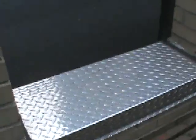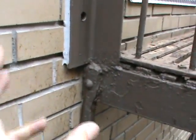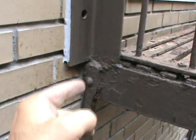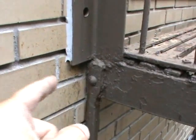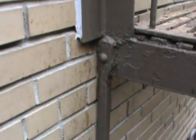Any cement work, identify it so that a mason can do it, but anything within our capability belongs to us. Usually a 4 to 6 inch square of our piece. You got to clean those out and verify it if we're going to load test. If we're not going to load test, that rivet's got to come out and we put a new bolt. Or if there's room, we leave the original rivet, it has no evidence of rust, and we put a backup bolt.